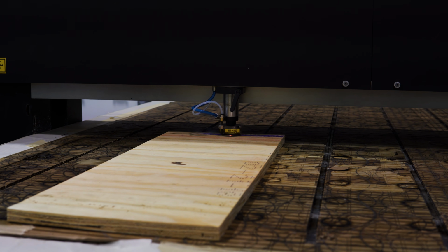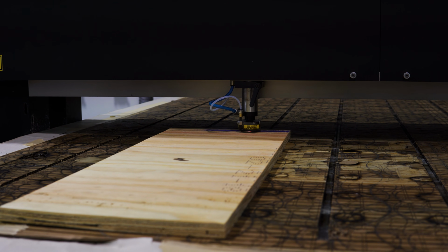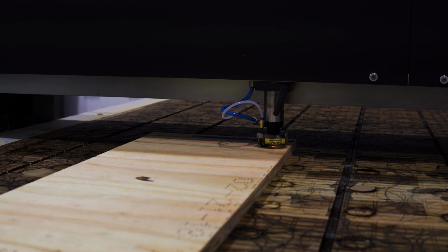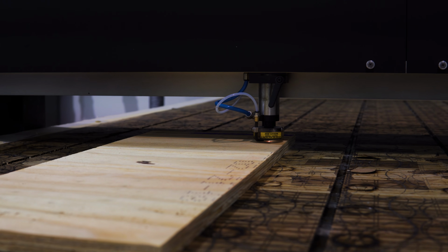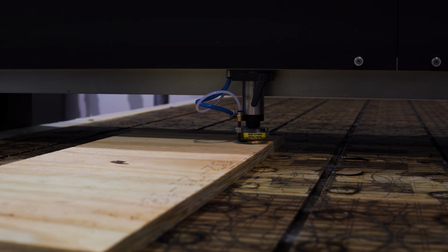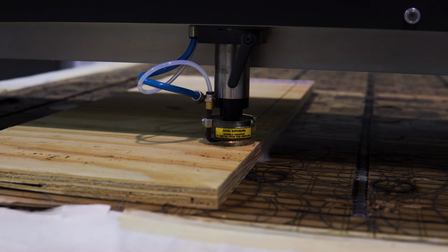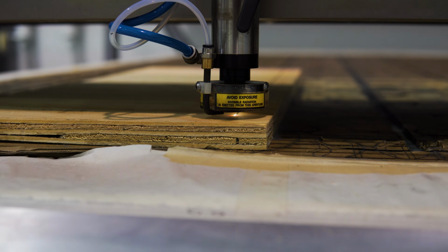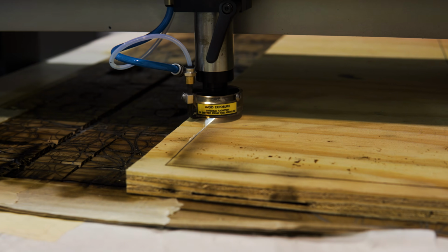So Beth just held up our sample template, and now this is cutting the final templates that we used for the bolt patterns. Obviously when you've got these stem wall forms, you want to make sure that your bolt patterns are perfectly placed because they have to match all of the LED modules. So we came up with the idea of cutting plywood templates that we screwed to the top of the stem wall forms, and then we laser etched center lines on here. As long as we could set a string line from one end of the form to the other, and then line that string line up with the center lines on each of these templates, we were able to know that our bolt pattern would be in the perfect location. These ones were a lot easier to do because they were just J-bolts that we put in.